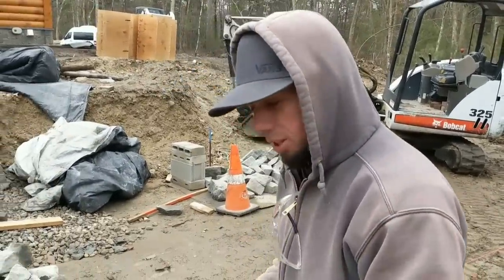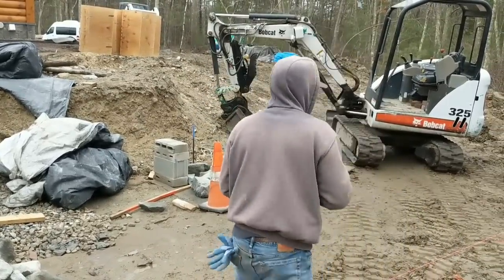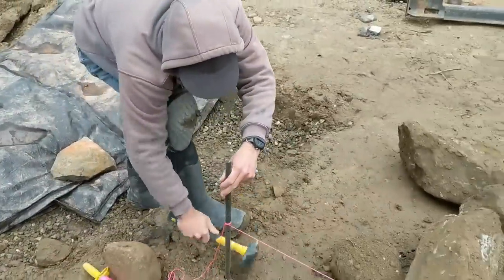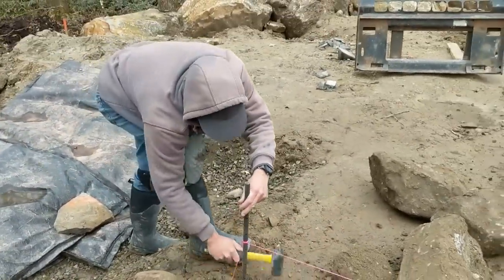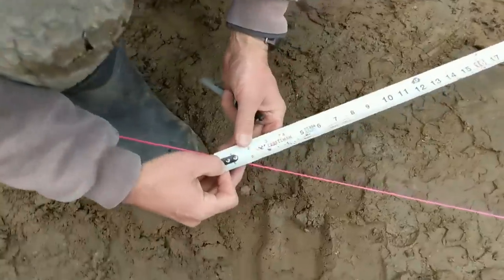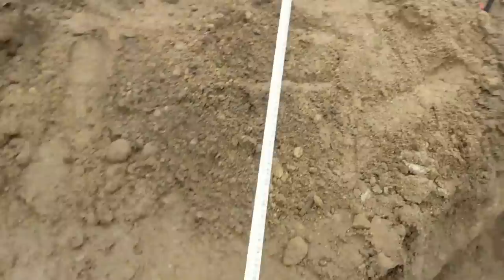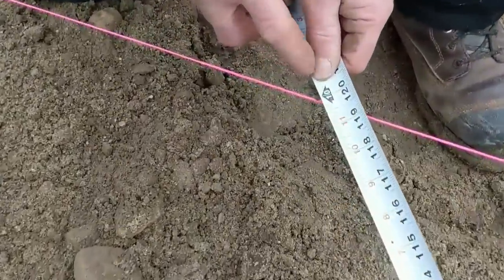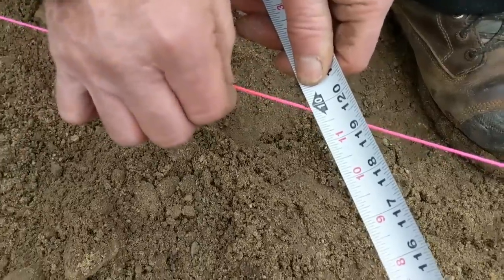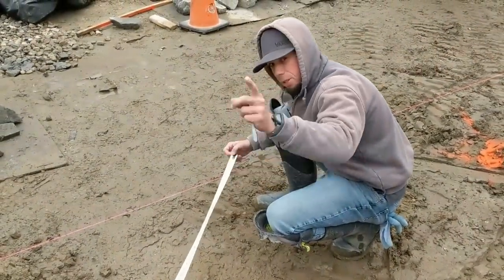So now we need to manipulate this line. You're off an 8, so we've got to swing out — just a tap. We're going to swing out our line a little bit. I'm going to manipulate this pin a little bit, holding on my mark. Show him what square looks like. See the 10 right there on the black line? The key is to have the tape measure on the corner, same side down the line.